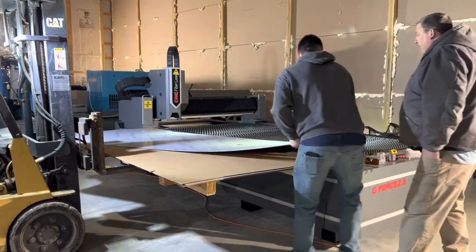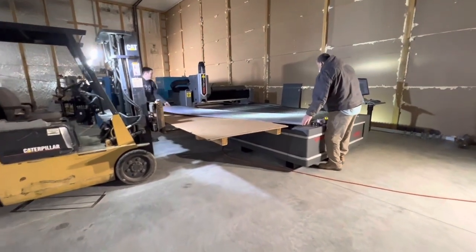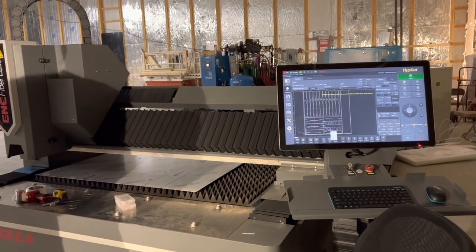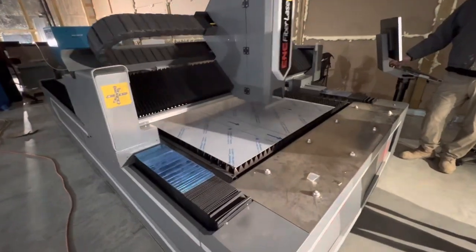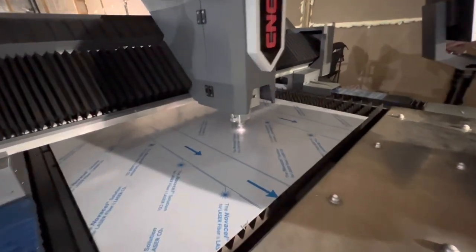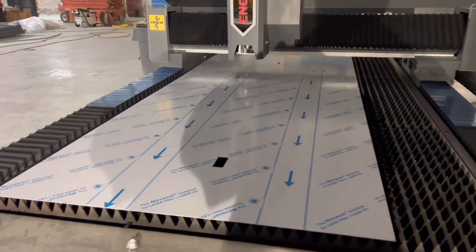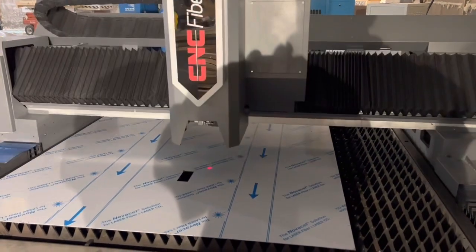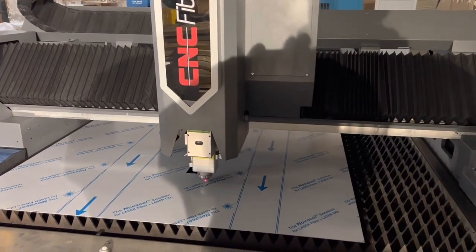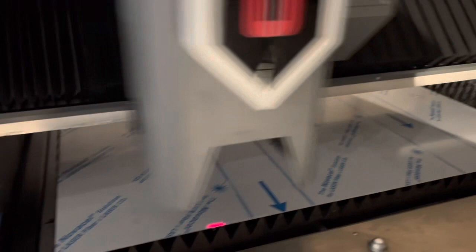Jeff and Cameron are loading on 14-gauge stainless here, and we're working through some training with those guys. These two are awesome — super patient, happy with the machine, and very patient with the issues we were working through. I'm all about full transparency and full disclosure — showing you all the problems and all the issues. Whatever comes up, we're going to be right on it to get it taken care of. Here's an edge seek — the movement you just saw was at 1.5g. We actually turned the edge seek speed down because we were still getting the hang of it.